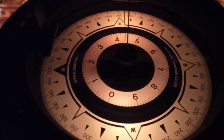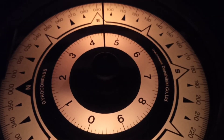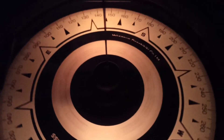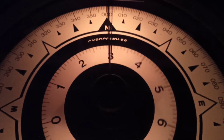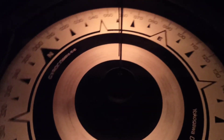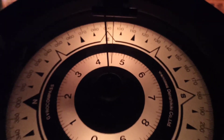So let's start. Please observe the video — I will now pull up this toggle stick and observe what happens. That's it. As you can see, the disc spins by itself and will move to course 0.0, then it will spin until it reaches the course we noted, which is 094.4. That's how you synchronize the gyro repeater.